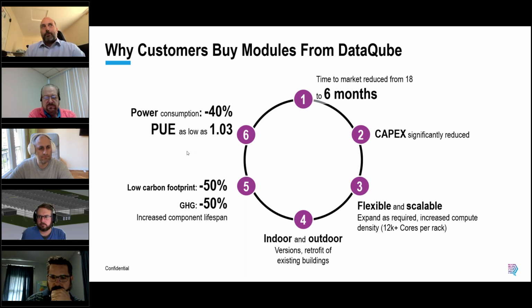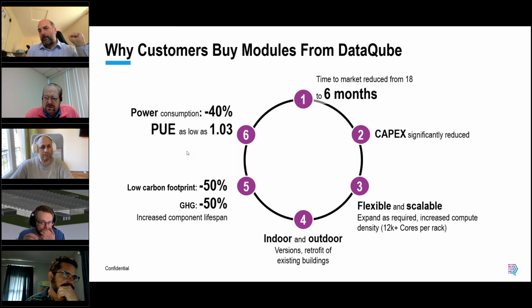The other point, as I'm sure everyone on the call knows, is that if you adopt liquid cooling in these facilities and you've done it at sufficient scale from a power perspective, we have the complete ability to capture that waste heat and repurpose it for heat recovery purposes. And we're working on lots of different solutions. Anything from design work for somebody who wants to heat public swimming pools and public service areas, to other projects involving hydrogen plants, where we're going to use the hydrogen power to power the module, but then use the waste heat to help with desalinization to provide water back to the plant.